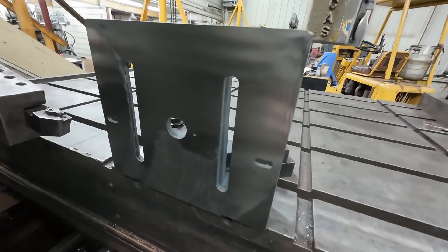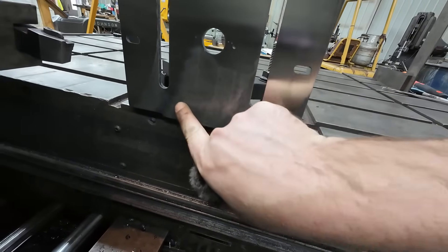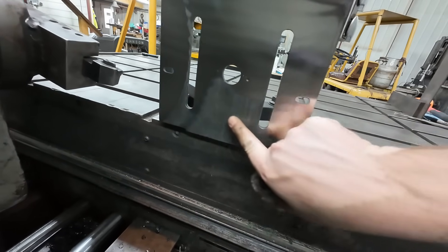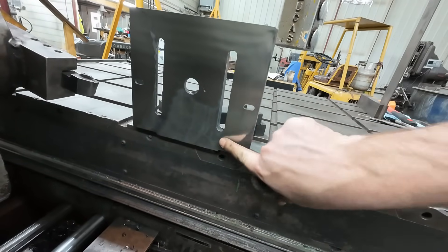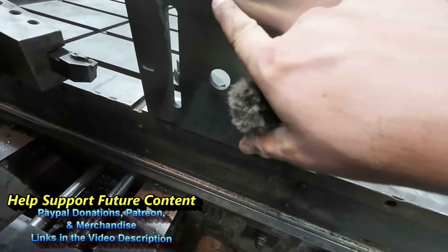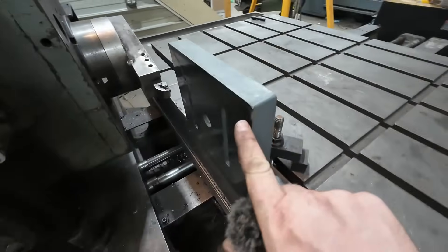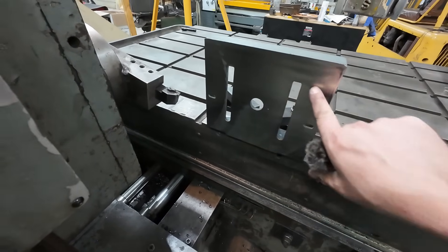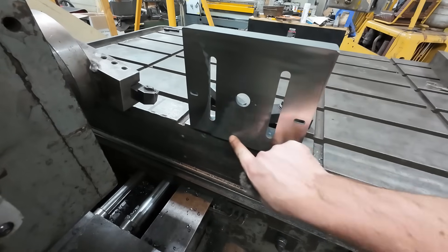Alright, so I wanted to bring this out to better lighting and it's looking good, except it didn't touch there — this whole area hadn't touched — and this is a deep gouge like we saw earlier. That isn't touching yet either, but it seems like 5 thou is a safe number because I think any more than that we're going to get some chatter. I may have to slow her down just a little bit, but overall that looks very nice. There isn't a lot of support on this thing and there ain't much to support on, so that's where it gets a little iffy. I think I am going to slow that down just a little bit to try to curb any vibration because I feel a little bit there. Five at a time seems to be a good number — I think two more passes and we'll have all of this done.